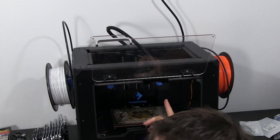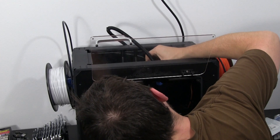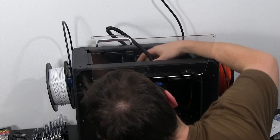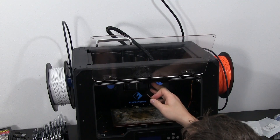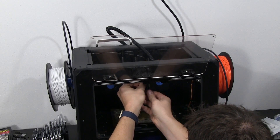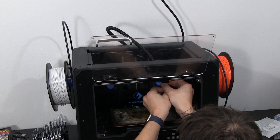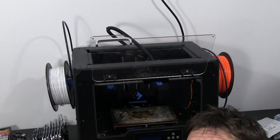Here's a little trick. Once you've got your extruder in, your carriage in, to balance the sides so they're level — instead of trying to move the bed and adjust the nozzles — what I found is you can put a small piece of something on one side and then tighten it up. I happen to use foil. The nozzles have to be level; if one is slightly not level, one nozzle drags across the print while the other is printing, and it's just sad. That small piece of foil keeps the nozzles level and it prints well.